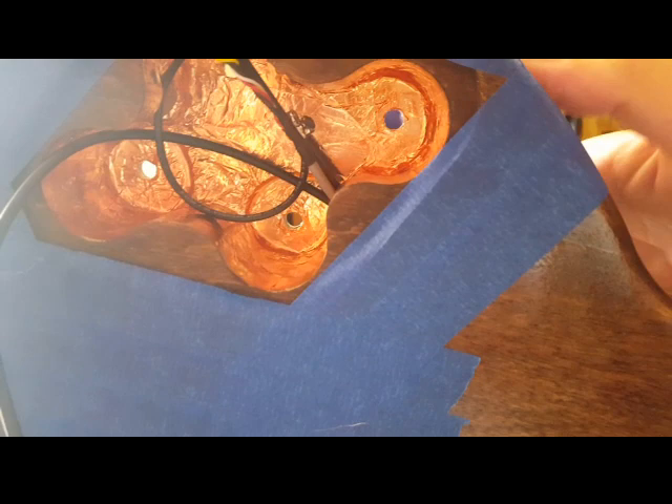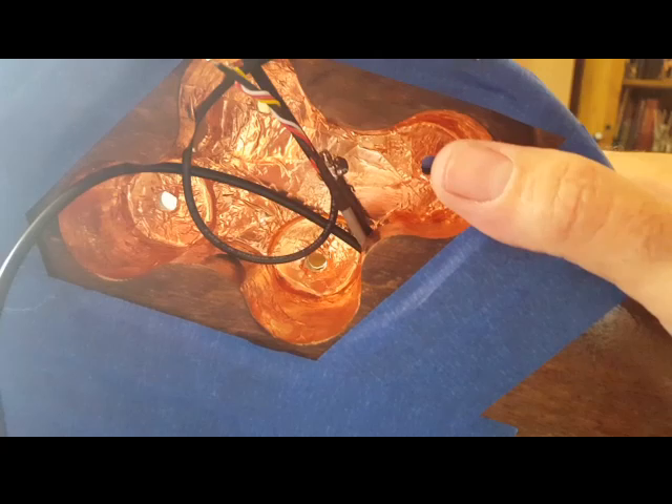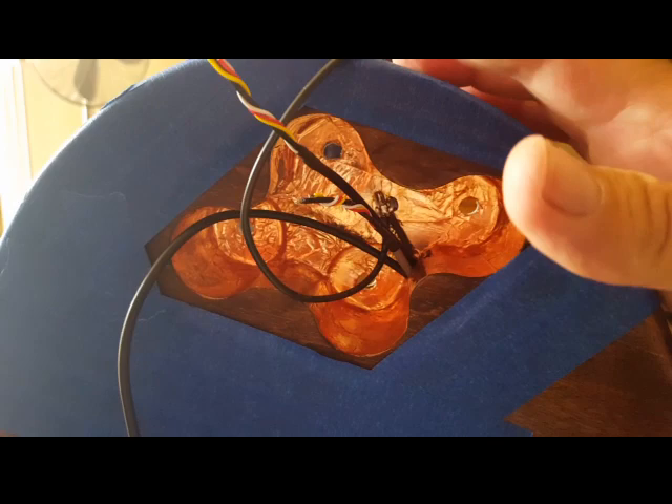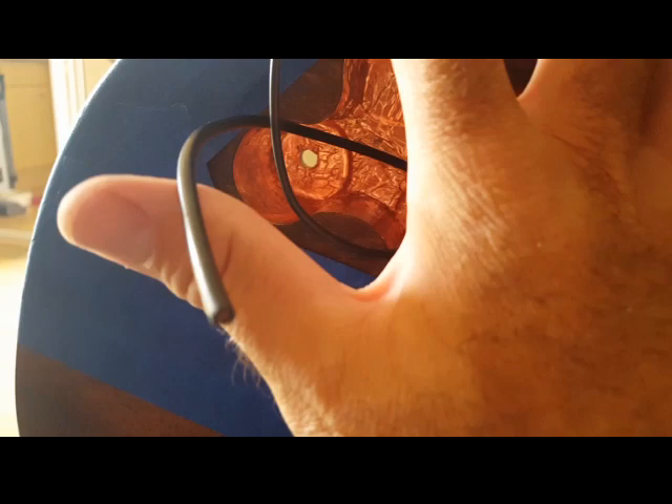You will get a little bit of spark — mainly static, a bit of residual. Got my wires running for the pickups: black set is for the bridge, grey set is for the neck. And we've got a fly lead which we're going to attach to the pots to earth it. Then it'll be the main wiring harness. This black cable here runs straight through, down to here.